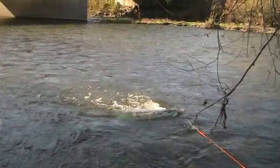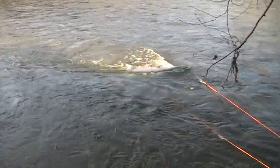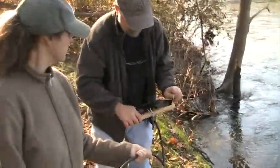October 23, 2011 — this is the Sailing Shroud's first trial run. The Susquehanna at Main Street in Oneonta, New York is selected and provides trees for tethering. The river is flowing approximately 4 feet per second, producing a rotor speed of approximately 150 RPM. A voltmeter is used contacting the rectifier with probes and measures an average 26 volts DC with no load.